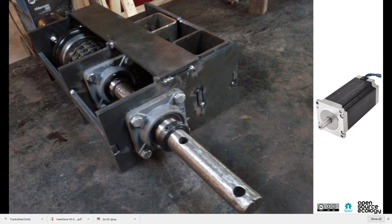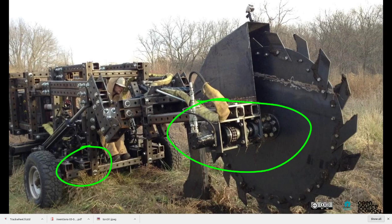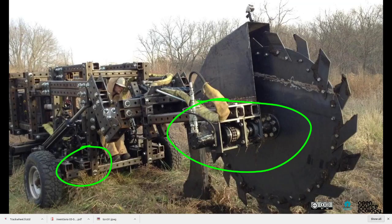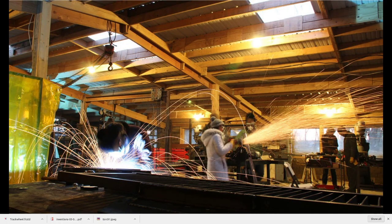So effectively, if you take a look at the stepper motor, the big one on the left is the industrial grade version of that, controlled by hydraulics, which we use in machines like tractors, where you can see the universal rotor driving either the big trencher wheel or the actual wheel units on the tractor. The power units, like for example, this is a small tractor which uses one power unit, and this can go up to 25 horsepower, or this tractor here has three power units, so this one is 75 horsepower. So this is modular frames, universal rotors, power cubes, and you can then talk about controllers.